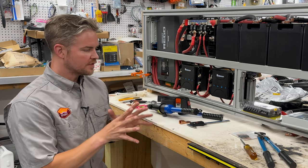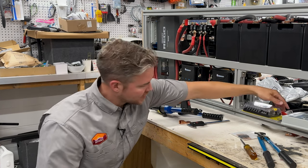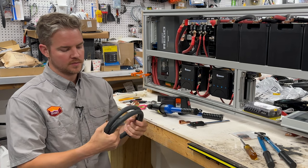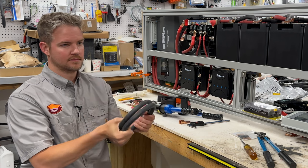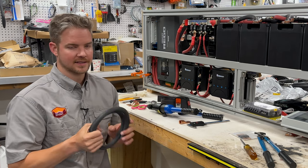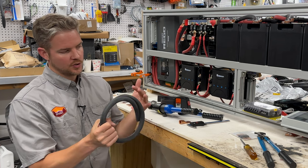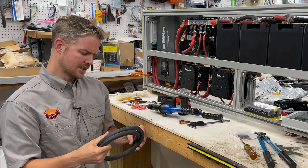All right, let's talk about tools for crimping and making all these connections. So first, we need to have our power cable. Our power cable, I get it from a company called Windy Nation. Again, these are all in the VanBuilder HQ DIY VanBuild cheat sheet. You buy them in lengths of 10 feet, 25 feet, 100. However, you will find that 4-aught, which is a very chunky wire, is very expensive. 10 feet of red and black cable is about $150 on Amazon. But what's nice about that is you do get color-coded cables. And typically 10 feet is enough to do a typical battery bank system.